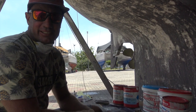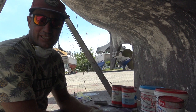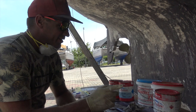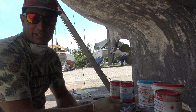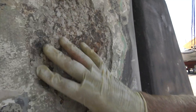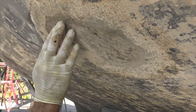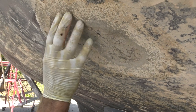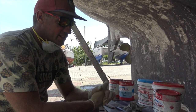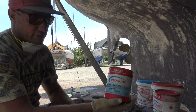So we constantly get asked how to fix a ferro, and I've actually got the products out in front of me now that I use and the procedure in which I do it. What we start with is what we just showed you — I've chipped out where the blister was, brought that all back to nice clean concrete, cleaned it up, gave it a good wash down, gave a little clean up with alcohol, and then the next step is to seal it with this Ultra Lock.